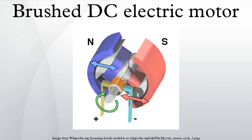and cool rapidly. Field weakening is used in some electronic controls to increase the top speed of an electric vehicle. The simplest form uses a contactor and field weakening resistor. The electronic control monitors the motor current and switches the field weakening resistor into circuit when the motor current reduces below a preset value. Once the resistor is in circuit, the motor will increase speed above its normal speed at its rated voltage. When motor current increases, the control will disconnect the resistor and low-speed torque is made available.